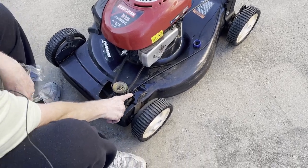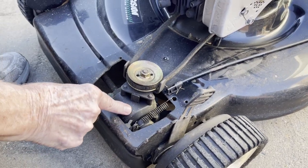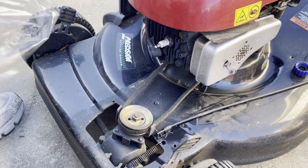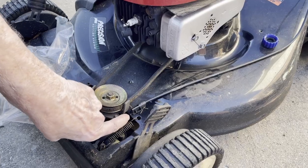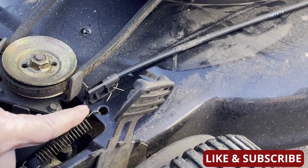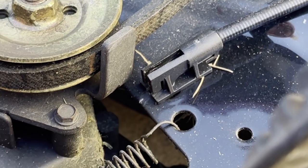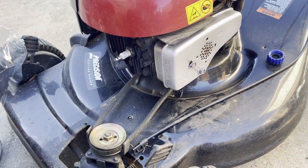What happened here: the end broke off the cable that pulls this gearbox up to put tension on this belt to make the front wheels get power from the engine. The end broke off because it was installed wrong — they had it going over the metal here, and you can see where it scraped the paint off, and that's what wore it through. If it had been installed right at the factory this would have never happened, but it did happen so I've got to change it.